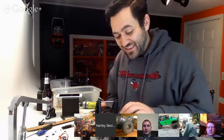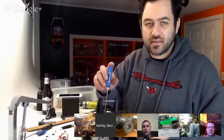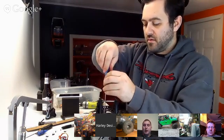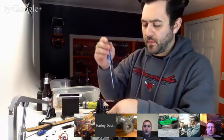Right. You can run those things right on like 3S LiPo. Really? Even with the stock controller? Yeah. No, you need to swap out controllers. Right. A spare ESC or whatever you got. Have you ever used an ESC to power your lights just to get a variable brightness? No. You know what I mean, though? Because you can use a brushed ESC. Yeah, if you put it to brush mode and did that, yeah, it would technically work just fine.